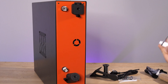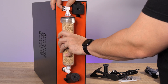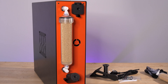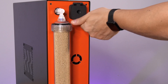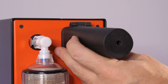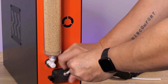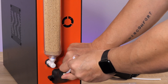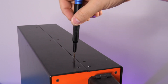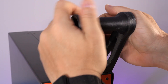Setting up the machine is actually very easy out of the box. You attach the dry capsule using a quick-lock mechanism — just push it in from the top and bottom and it sits in place. If you have the preheater add-on, remove the existing inlet cover and replace it with the preheater. Install the PTFE couplers and tubes. To install the spool holder, remove the four hex screws at the top back of the Drywise unit and screw them back on with the spool holder in place. Switch it on and that's pretty much it — there's no calibration setup to go through.